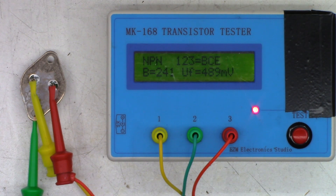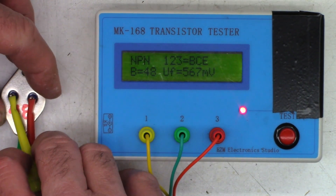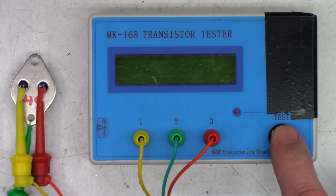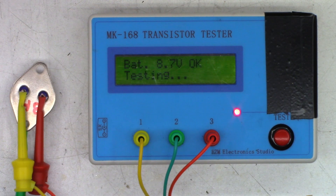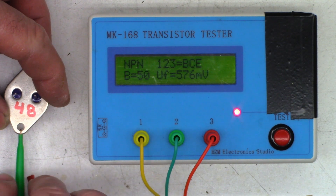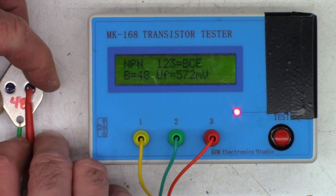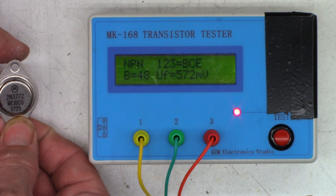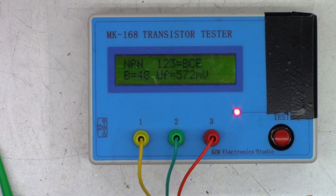Let's test the new ones and see if they're closely matched — I matched them about a year ago but we'll test them again. That's more like what I'd expect: beta gain of 48 and Vbe of 0.567 volts. I already have this one marked as 48 from a year ago. The next is 50, tested as 49 a year ago — the numbers look very good. Another 50 — absolutely perfect, even though I had it marked at 48, 50 is close enough. And 48 on the last one. Very happy with all four. These are not 2N3771s — they are 2N3772s, which have a higher voltage rating, though that won't matter in this application.